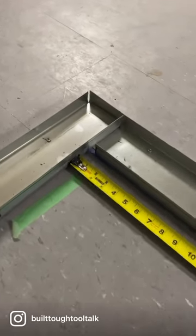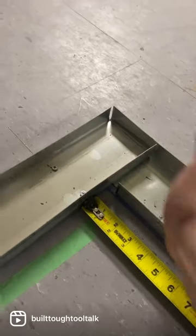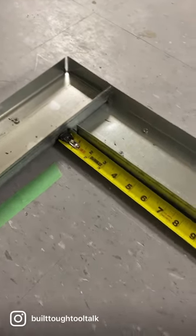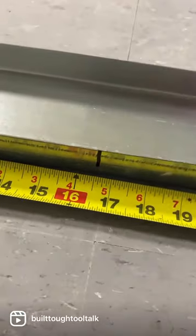Here's a little tip when you're framing with steel: this little slot here — you're gonna pass the board through there, then you're gonna have a stud tight against that drywall. We call that the locker stud. So when you're doing your layout, instead of marking 16s, if you're using half-inch drywall, you're gonna mark 16 and a half.